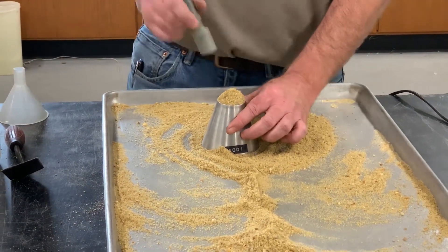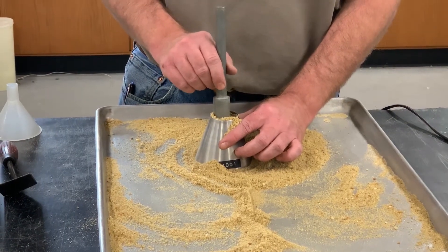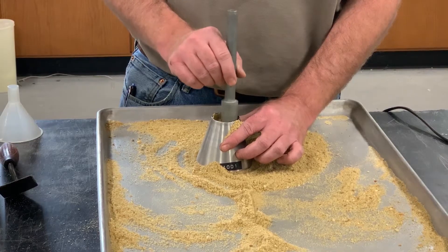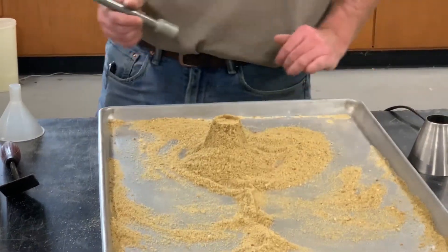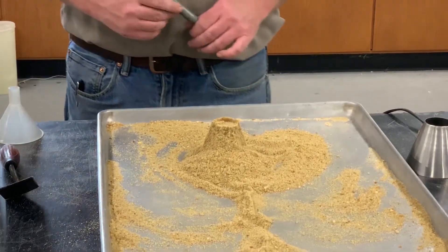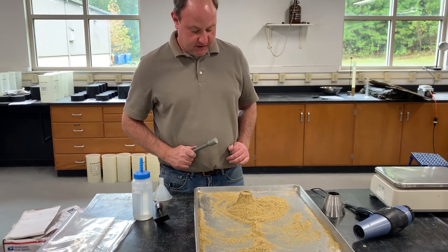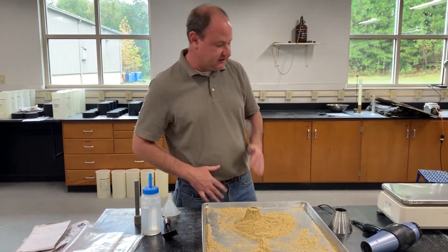After a few more minutes of drying, we check the SSD condition again. Fill the cone with aggregate sample, then do 25 drops at 5mm with the tamp. This time we can see the slump — about half the cone has slumped — so we consider this material to be at SSD condition.